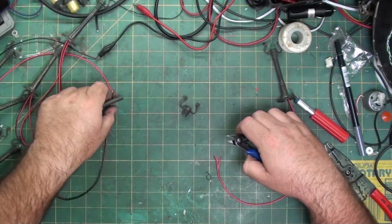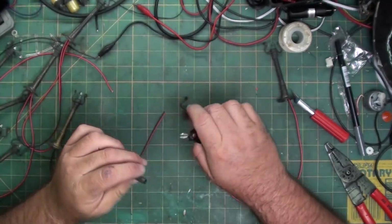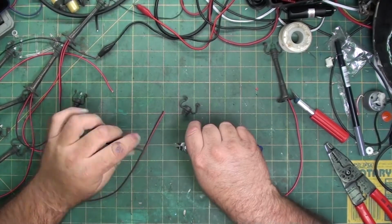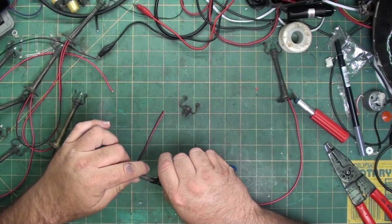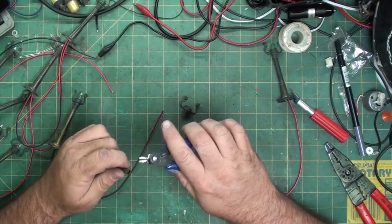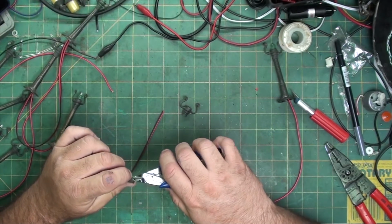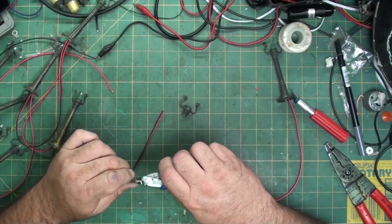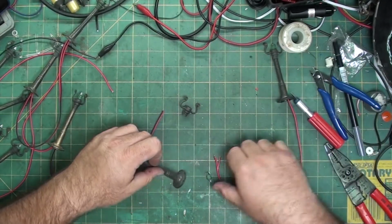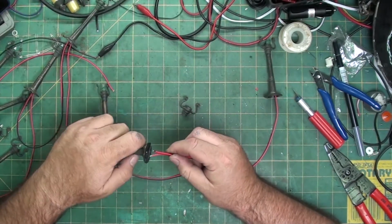What I figured out was that if I remove this divider piece I was telling you about that split the wires, it actually works pretty good. So I just use a pair of small cutters and get it out. If you can find these lights, because I don't even know what they are since there was no box, you can maybe use an X-Acto knife, or just try and break it out with a screwdriver. And then feed your wires through.